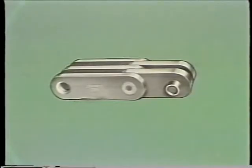Now we have draw bench chain. Draw bench chain is of an extremely robust chain design using high grade steels which are carefully heat treated. This heat treatment is used to give the chain superior strength. The superior strength is needed because a draw bench is where we pull a mandrel through hot metal and as a consequence the chain must have tremendous strength. Draw benches are normally found in steel mills or tube fabricating mills.